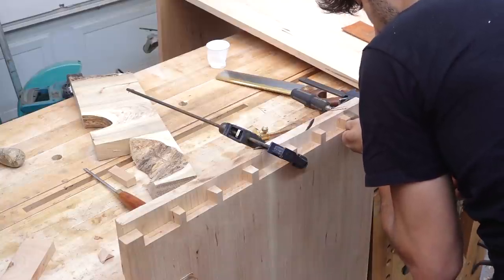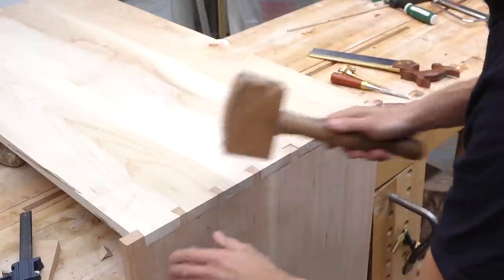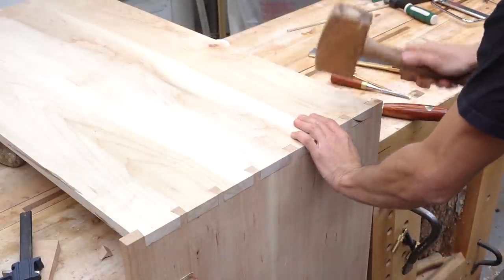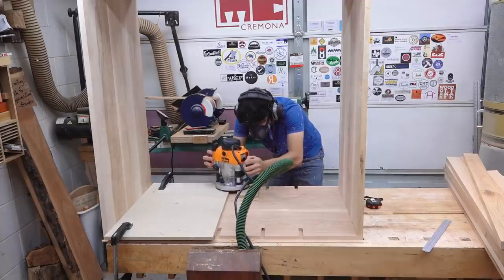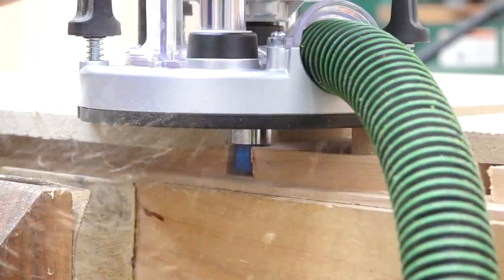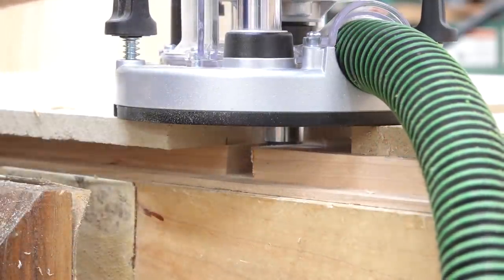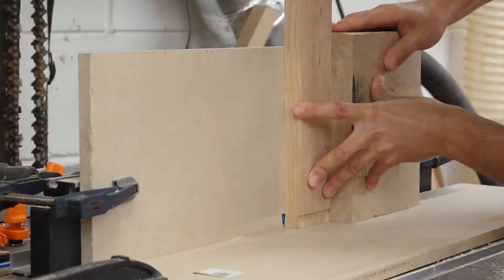It's kind of nice to get back into doing some of that. Something I did a little differently with this case is I did both tails first and pins first, just to kind of demonstrate the difference between the two techniques and how it's different at the scale of a large case. Once the case is all dovetailed together, I could put in the drawer dividers, and those get installed using a sliding dovetail. I have a front divider and a rear divider to complete the whole framework of the case.